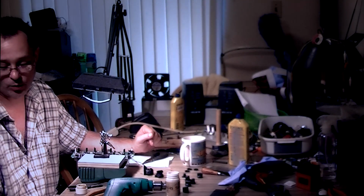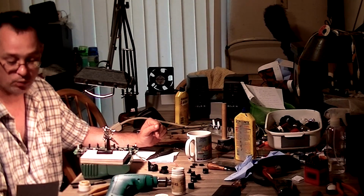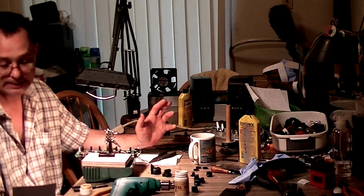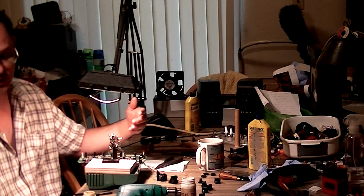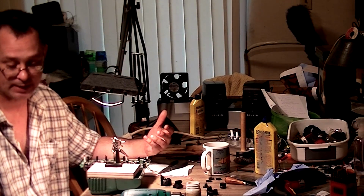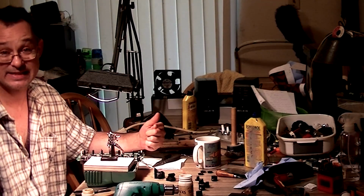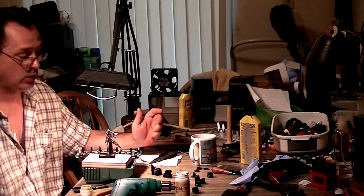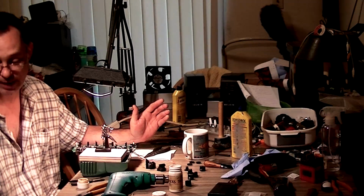In mine, I'm going to go with 22K. A 24K resistor will provide some boost. Stock is a 36K, and that's where we're getting that it's quiet. So by reducing that value to 24K, you'll get some boost. It'll be a little bit louder. 22K, he said, was too loud. 26K for this guy was perfect. Well, I only have 22K, and I like it loud, so that's what I'm going to go with.